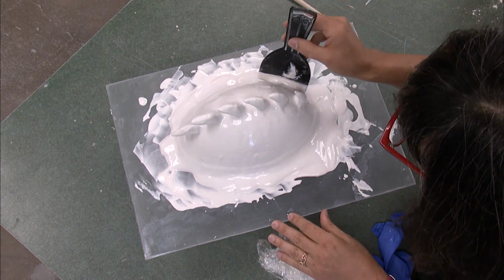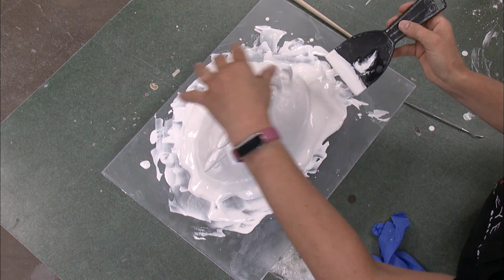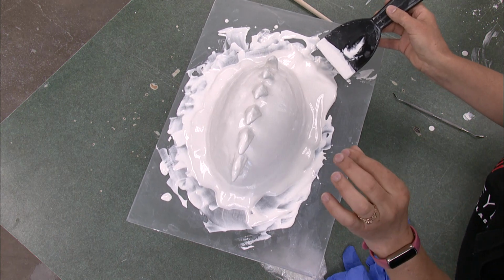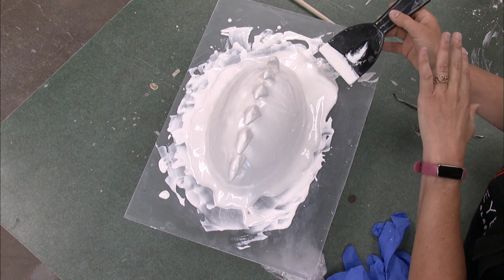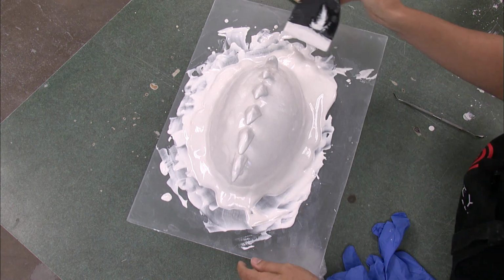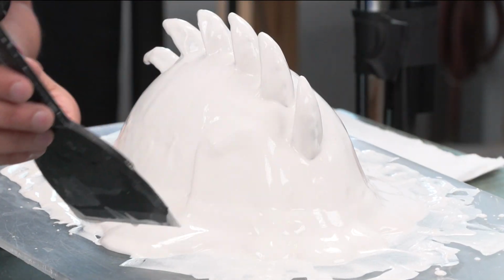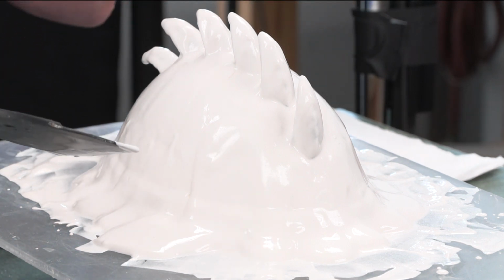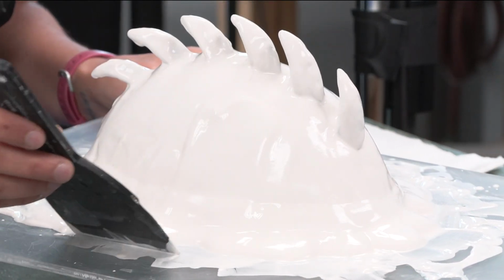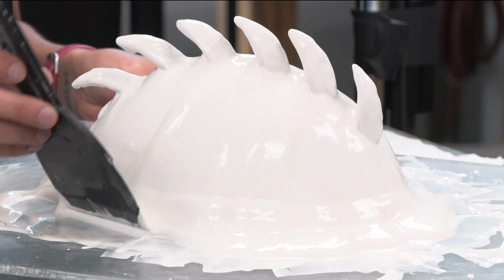The other thing that I haven't really done, but I've only done it once. If you have a lot all over the whole surface, you can put like 1% diatomaceous earth into your 50-50 mix, and it creates a softer mold mix, as in it's much easier to divest afterwards, so it's more friable. It wouldn't be the thing you would want to create structure, but if you had to pour over the top of many small ones, you might want to investigate something like that, a softer mold mix that could dig out more readily and would be less likely to snap off your bits and bobs.